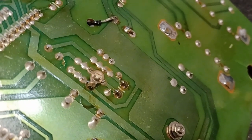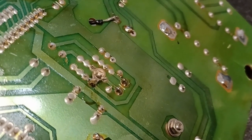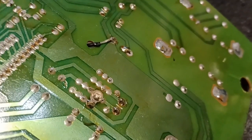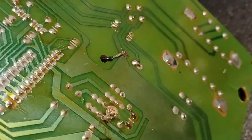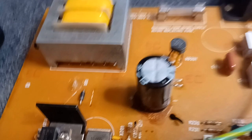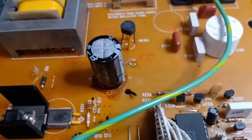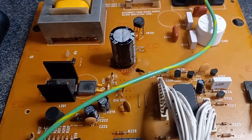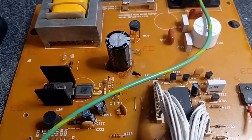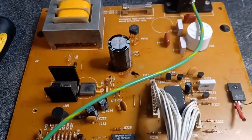And it looks like at one time or another that crystal's been replaced before. So it may be that cap, and I don't know what that wire is. Oh, the wire goes to nothing. The wire's up here, so I can take that rod on out. Okay, I'm going to go ahead and replace the crystal and replace the capacitor, and be right back.